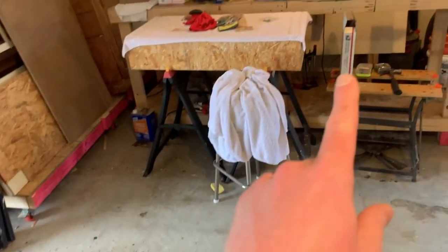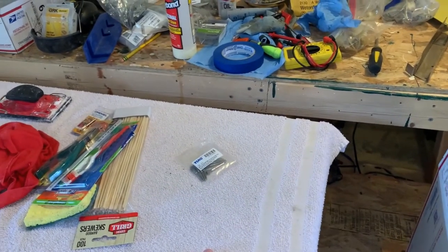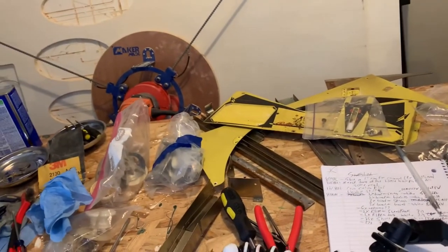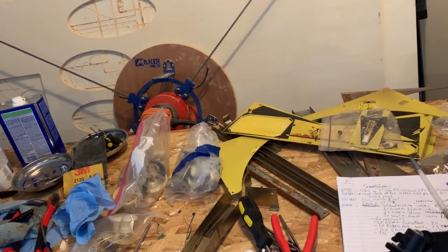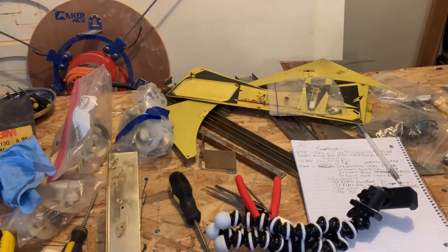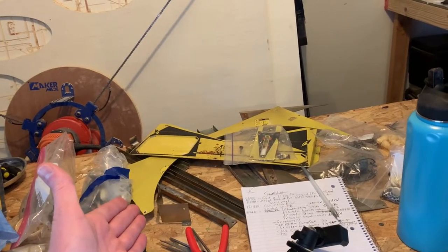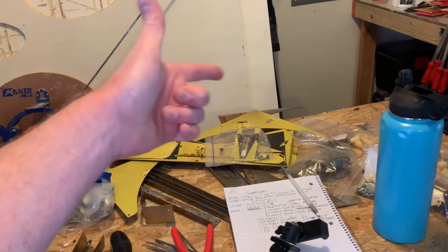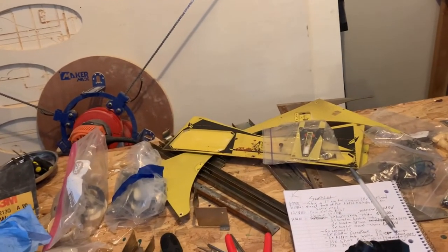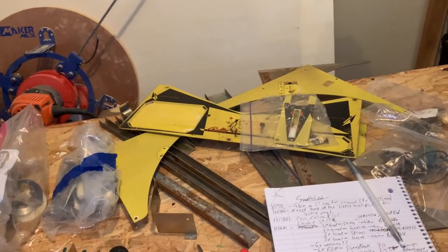Let's go through our box. The playfield has been sitting here under this towel so it doesn't get dirty. We're going to have to flip that over, rebuild some of the stuff and then put it on the rotisserie. We got all the top of the playfield parts and they're pretty nasty, a little rusty. I got a wire wheel for my grinder — most of them I'm going to grind and paint because they won't polish up nicely. I'm probably going to wire-brush the back apron and paint it the same bright yellow so they match. If I could find a decal I would, but I haven't been able to — let me know if you know where to get an apron decal that style.